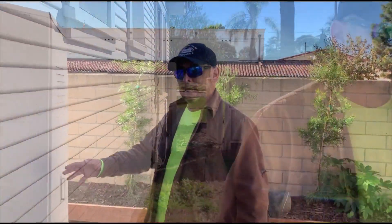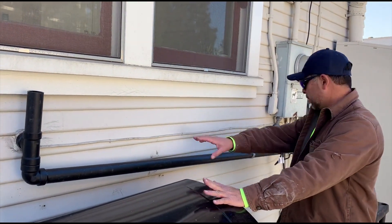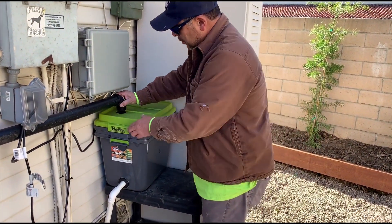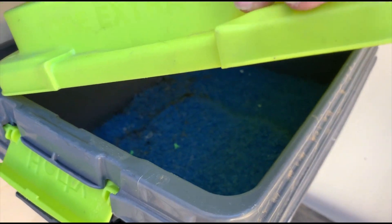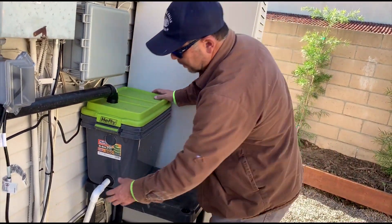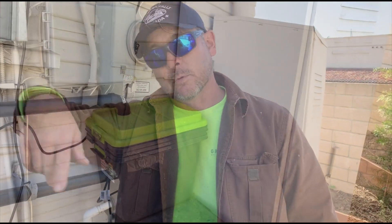It's the laundry, and we use a separate one to cover the other side of the house. Here is the laundry system. It was sitting over here underneath the laundry room, but this particular owner wanted to put his barbecue here, so we extended the pipe over to this section. It goes through the filter — same type of system, with filter material. This one shouldn't be as filled up. This is a smaller system, just like the other one on the side of the house. Water goes through here, comes out this PVC pipe, and then goes out the other side of the house. We'll walk over there and see that in the yard.